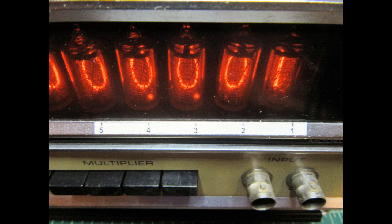Here's a photo of my IB-1103 with the label in place on the lower bezel edge and the tick marks aligning with the decimal point positions, and you can see that there are 2 decimal points that are on there, and if one looks at the chart, you can just say, well, the one above tick mark 3 should be on and the other one shouldn't. And that lets you at least take reasonable readings of unknown frequencies using the counter, even with the malfunction going on.